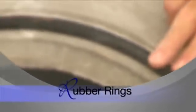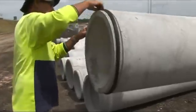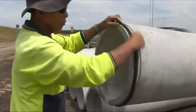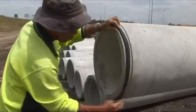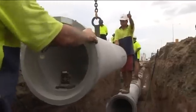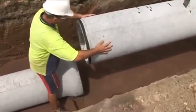Socket pipes are generally supplied with rubber rings for the joints. They should be kept clean and dry before application, and only use rubber rings that are supplied with the pipe. Before socketed pipes are laid, fit the rubber ring above ground and make sure the matching surfaces are clean and free of any debris. Ensure the ring is uniformly tensioned for ease of jointing. This applies to rolling rubber rings and skid rings.